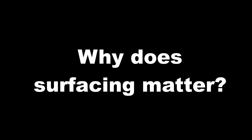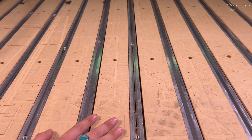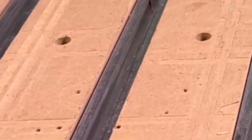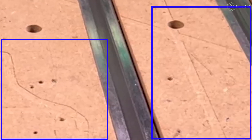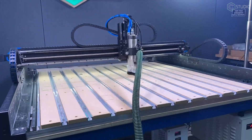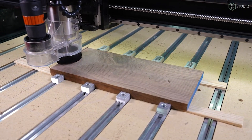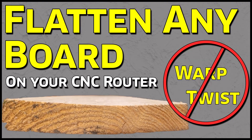It's important to periodically flatten the wasteboard with a spindle. This creates a flat plane in reference to the tip of the cutter, so our cuts are a lot more consistent in the Z-axis. Over time, the MDF on your machine may swell or shrink, you may have some buildup of adhesive workholding, or you may have a bunch of ridges and lines from previous projects. We'll cut a thin pocket across the entirety of our wasteboard in order to flatten that to the cutter. Our colleague Kevin Barnett has a video on how to do just that — we'll link that video in the description below.